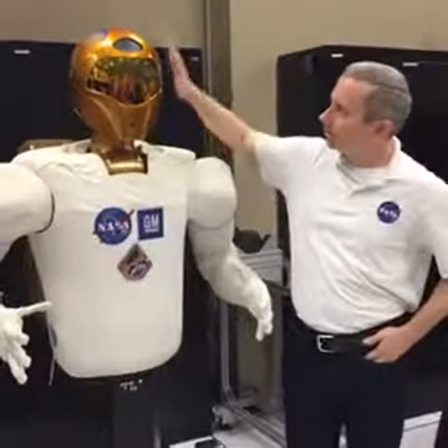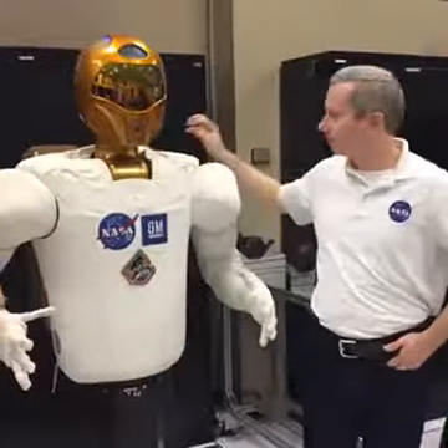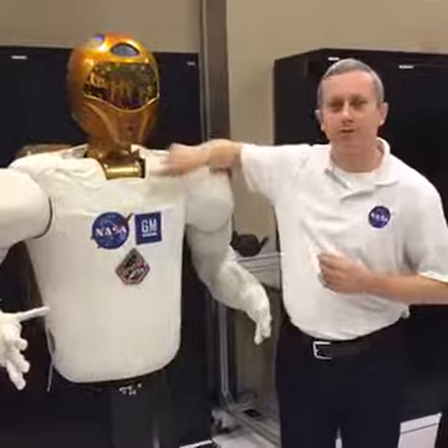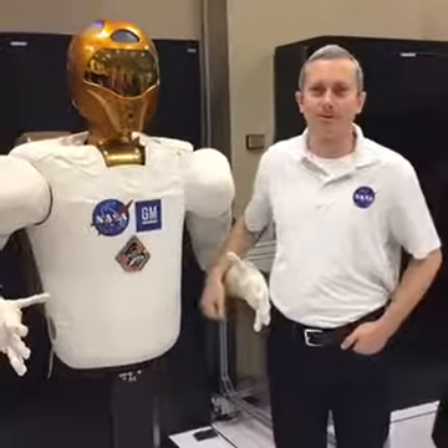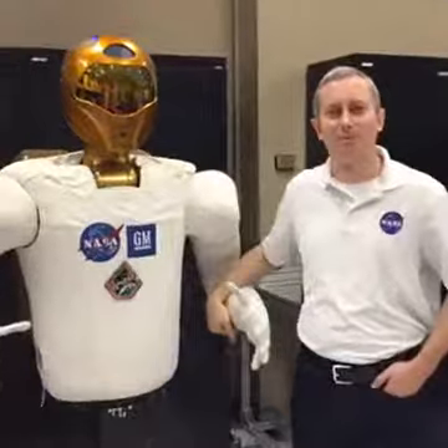On the helmet this is painted, but on the metal pieces of the robot, this is anodized aluminum. Anodizing is an electrochemical process that makes a very hard coating on the outside of the metal to help protect it, and as part of that process you can add in a dye. We've done that for years and it's kind of fun to show off.